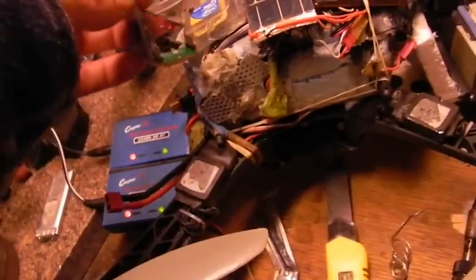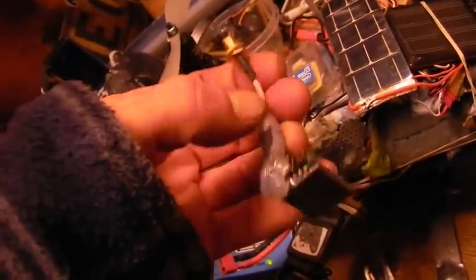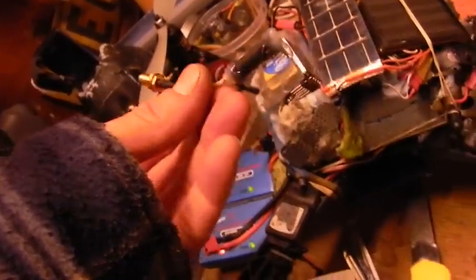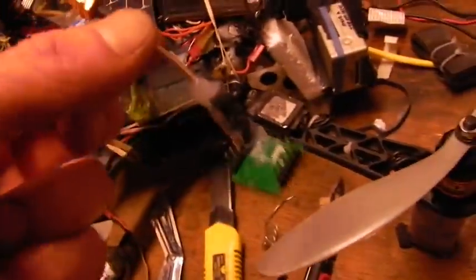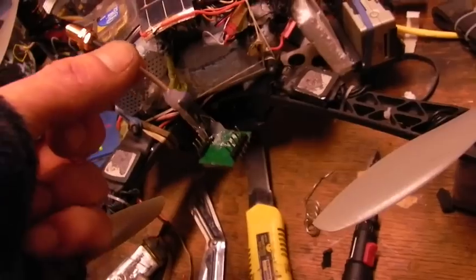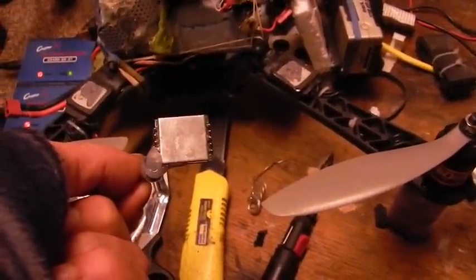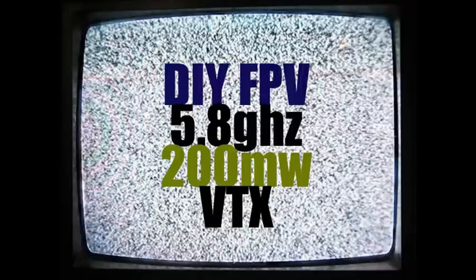So this one is quite short. If I provide cooling for this, I can add it and then bend this up because it is firmly glue-sticked onto this carbon tube — all my bending stress will be outside of the area where my soldering has been done. So that's the $28 VTX, 200 milliwatt, versus that clunky thing there. Eventually we'll do a test to see which has better transmission in a big open field. That's today's work — also welded up a bunch of stuff — but that's the hoverbot work for today, and we're ready to test this VTX. Thank you.